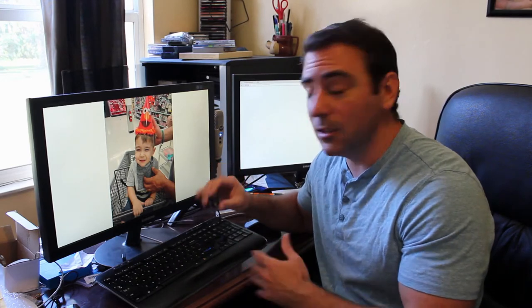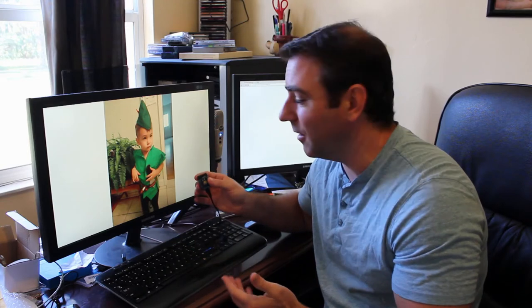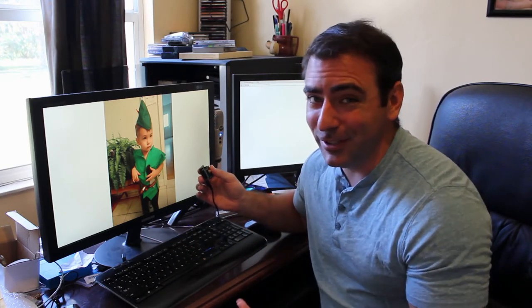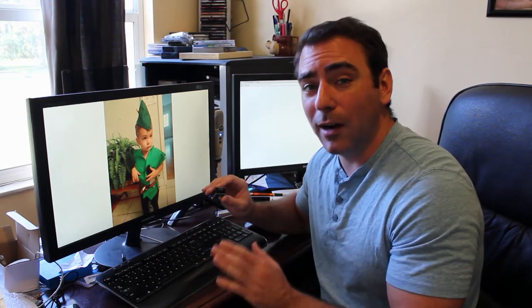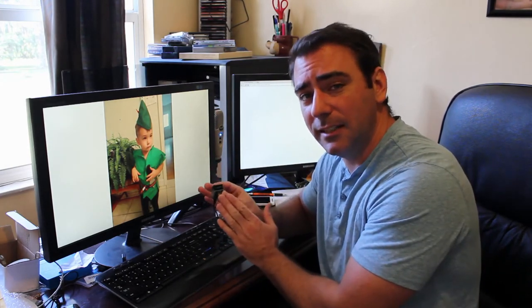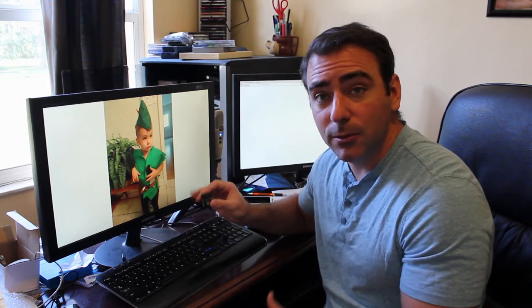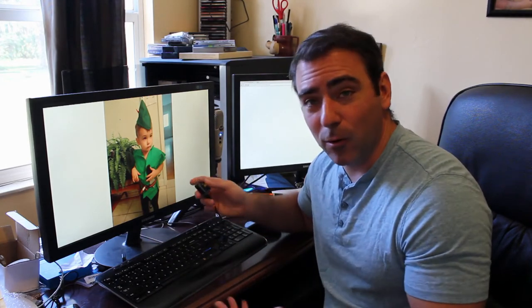This is using simple HTTP requests, so it's not the fastest thing in the world, but it's great — I click it and almost right away the picture shows up. You don't really notice the delay. Obviously this setup is not good if you're trying to control a video game or something like that. For that there are better options, and if you wanted more accuracy you could use WebSockets, which isn't something I've done with the ESP8266 but there is example code in the Arduino IDE. For most of what I do, HTTP requests are simple and fast enough.